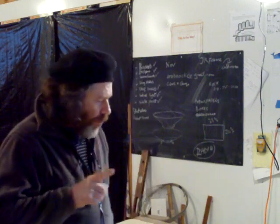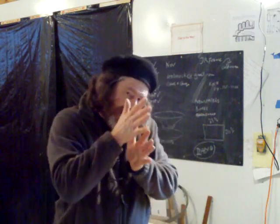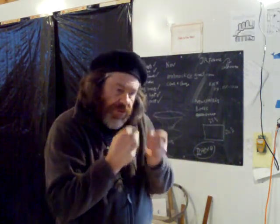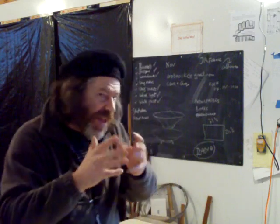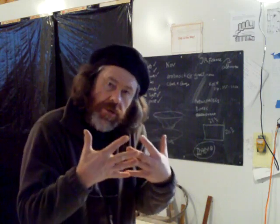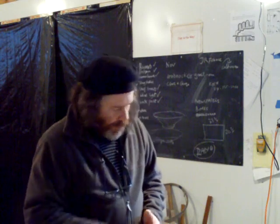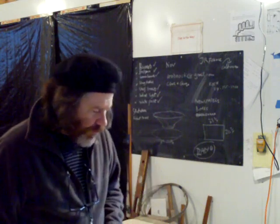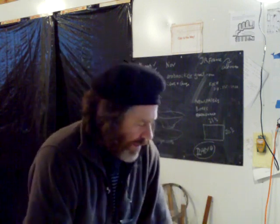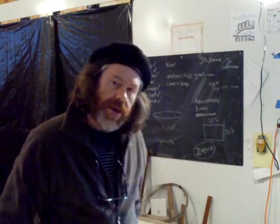One of the reasons I didn't want to put the chimney on the outside was that this ring here of bricks has got that stainless steel, and the heat transmitted through from the chimney causes the stainless steel to get very hot and ultimately break or disintegrate. So by having the chimney actually on the inside, apart from being more efficient, methinks, I'm going to preserve intact that stainless steel band around the outside of the kiln.